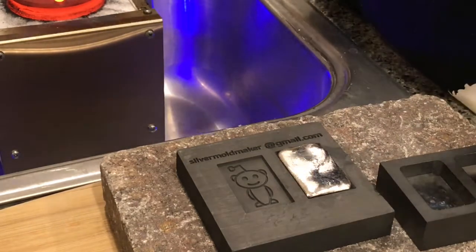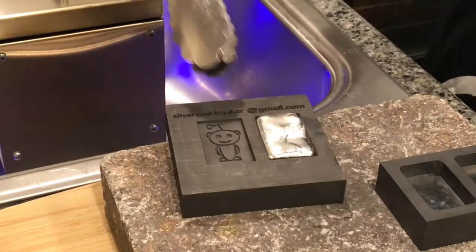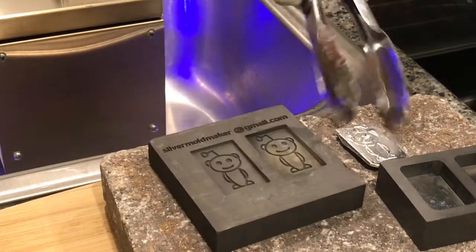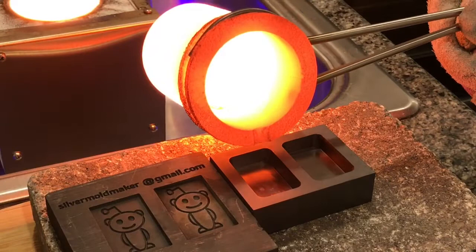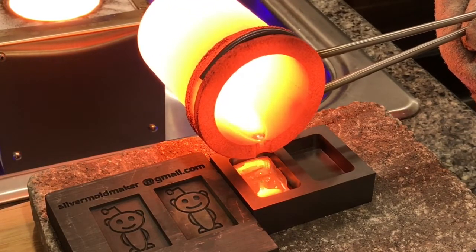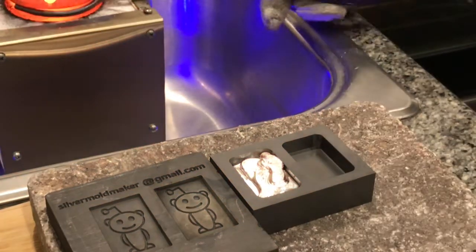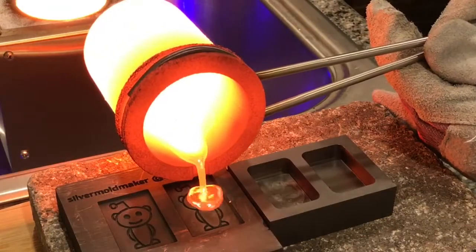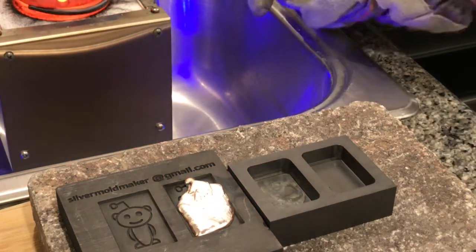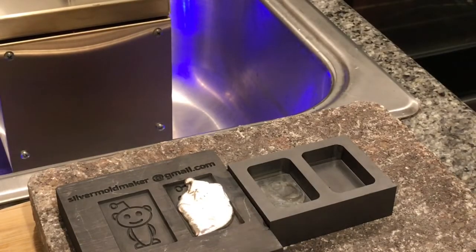I really watch and I study. Now that I'm recording and can see a bit more of what I need to do, I realized — also after talking to Silver Mold Maker, shout out to him for providing the mold and some advice — that the problem I'm having is that my mold is too cold. It's solidifying too fast and just rolling off the top. The other problem is I'm not controlling the molten silver well enough to get a steady stream — it's just too much on and off.